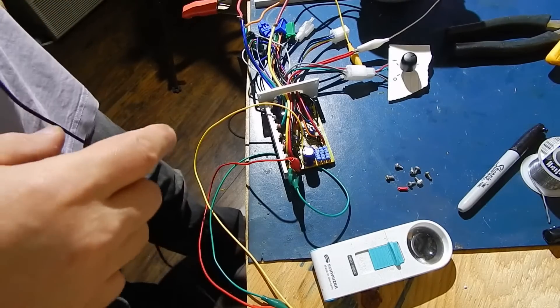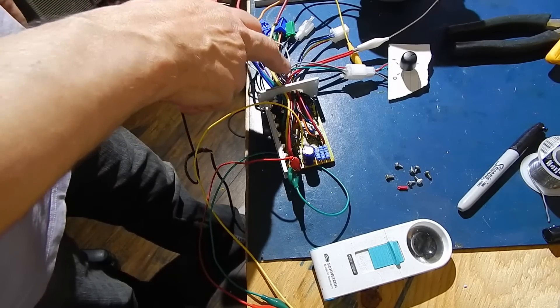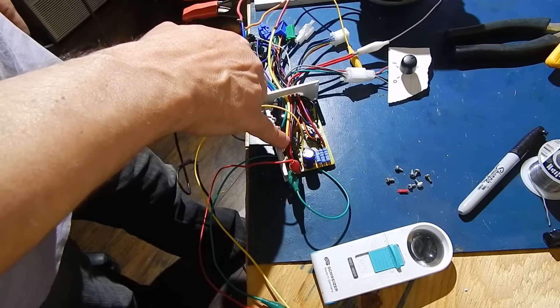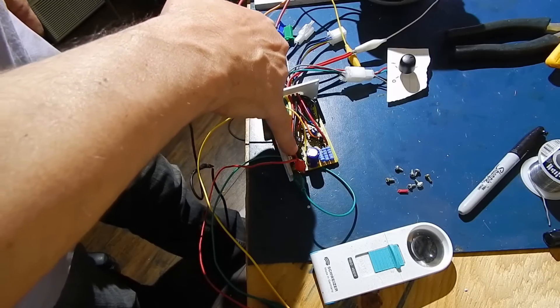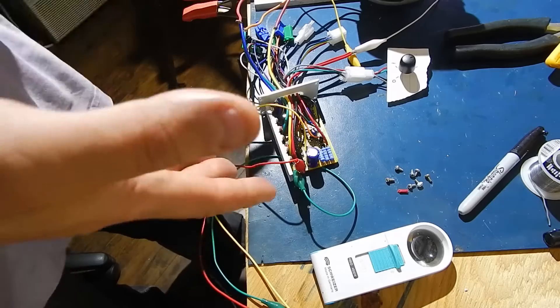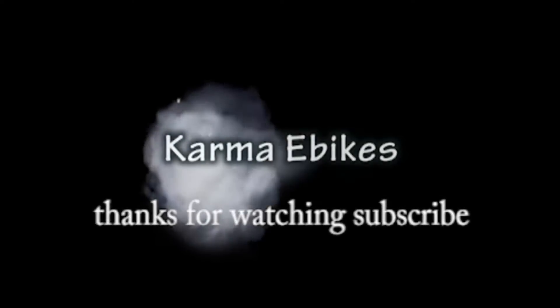Made an error guys — quick correction. You don't have to follow the positive in to find it. It doesn't measure the voltage across the positive lead, it measures the voltage across the negative lead. So just follow the negative lead in and it'll take you to the end of the shunt, and then the opposite side of that shunt will be your trace.